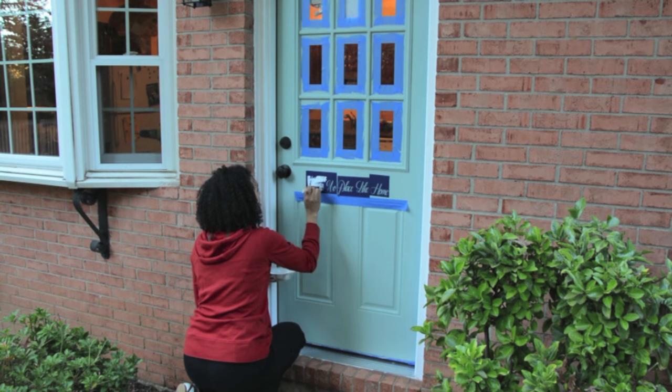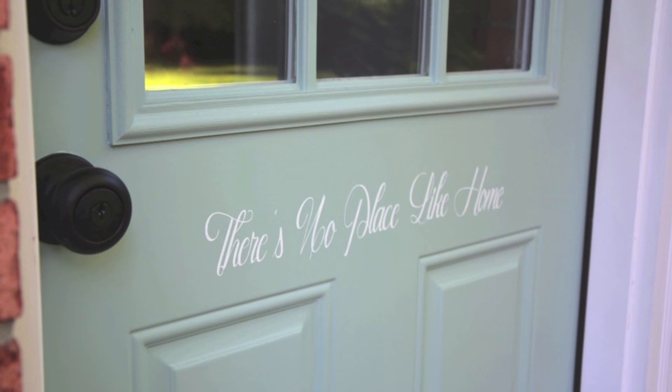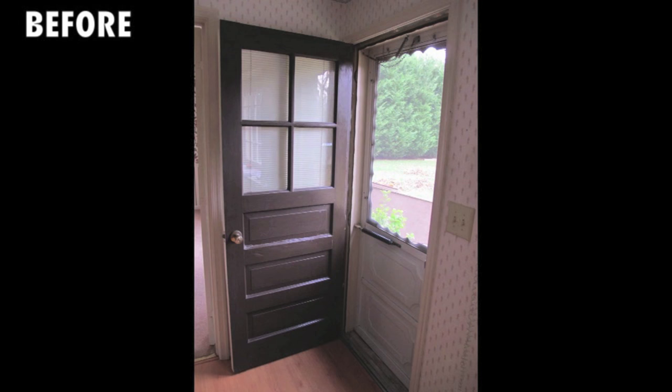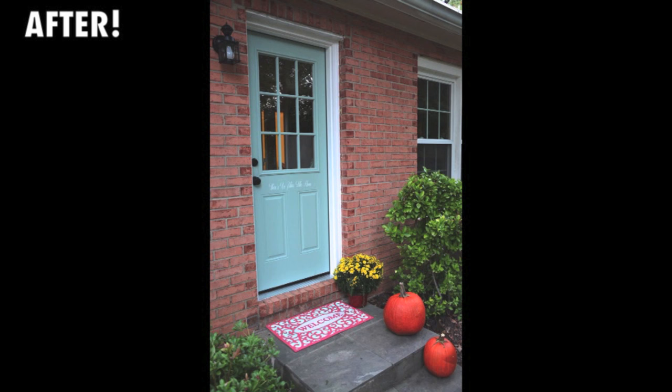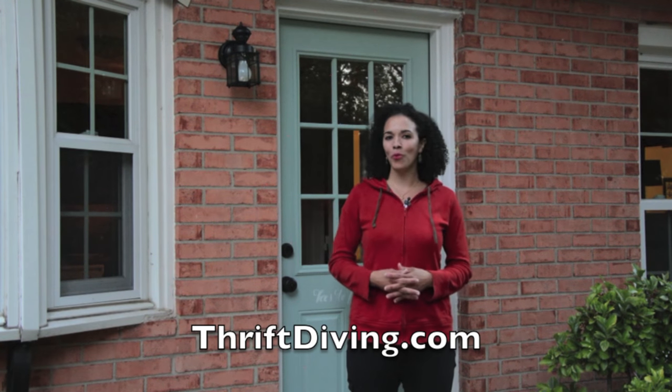If you're using a ready-made stencil, be sure to hold your stencil in place with tape, apply two coats of exterior paint, and when it dries, remove the stencil. We are done with the door makeover — we've stenciled it, we've painted it. With just about a day, day and a half, you can totally transform your outdoor area into something that you can be proud of. Thanks for watching, and for more projects, you can find me at thriftdiving.com.